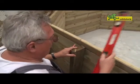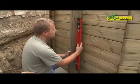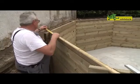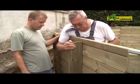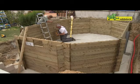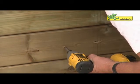Cut a length of post to 45 by 135 for the skimmer and do the same for the backwash inlets. Mark in where to drill the holes and put the posts in position. Drill the sides of the pool and screw in all the timbers, embedding the screw heads into the wood.